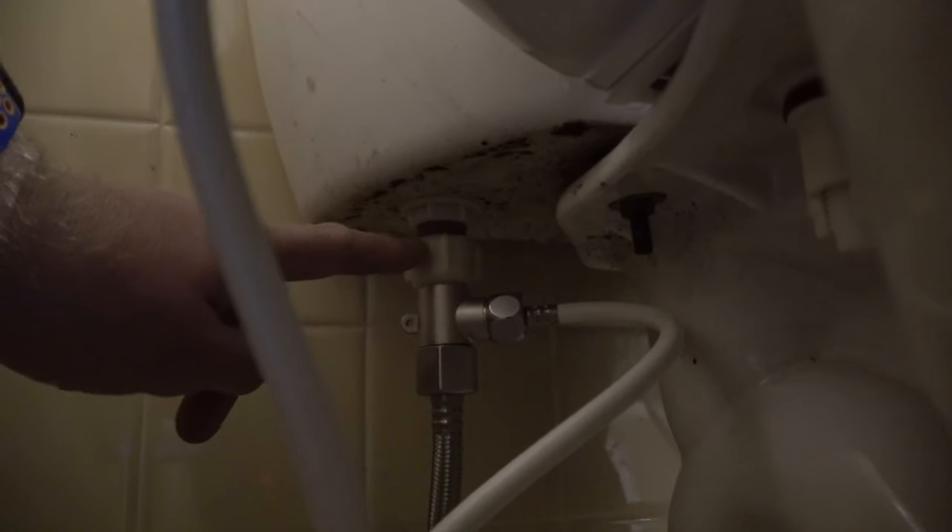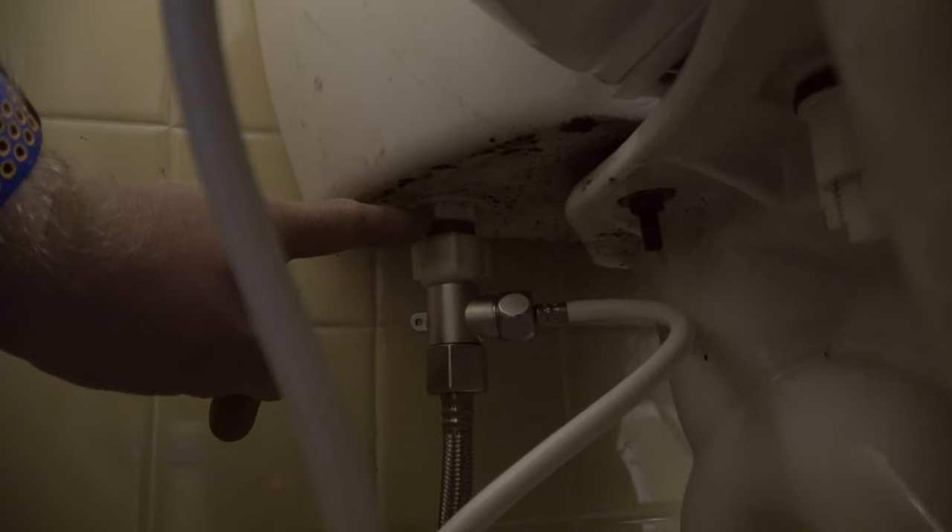Now we have everything hooked up and all the water lines are connected. Let's do a water test and check for leaks. Reach back here and turn it on — all the way open. You're going to want to watch it for a while — not just right now but over the next several hours — and check for any leaks. If you do have any leaks, go back and tighten things up. I did have a small leak, but not at my new fitting — when I was tightening the T, the tank fill connection up top loosened slightly. I tightened that up and it fixed the leak. I don't feel anything else but I'll keep an eye on it for the next day. You don't want any water leaks — make sure there's no water puddling down below.